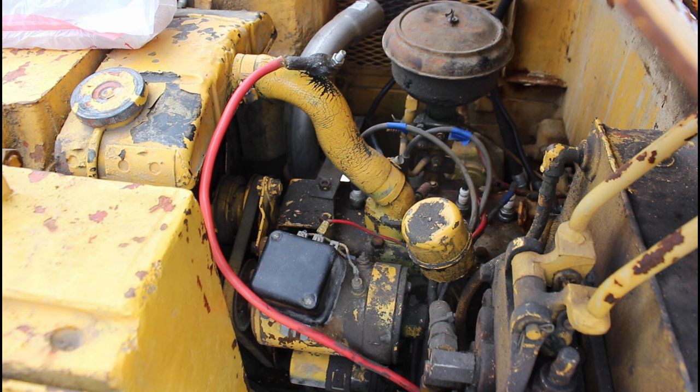If I can get it to crank, I don't have propane yet. I did order a tank, but I will maybe dump some ether down there. And I don't know if ether through that carburetor will work. Somebody's probably sitting out there saying, yeah, that won't work. But I'll give it a shot and see, because I'm not sure how those propane carburetors work. It looks like there's probably an orifice down in there somewhere, but it should get in there. So we'll give it a shot. So let's swap these out, and then we'll put it all back together and test her out.